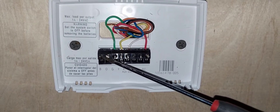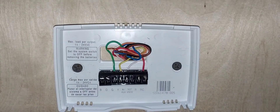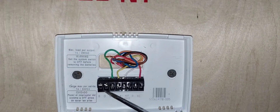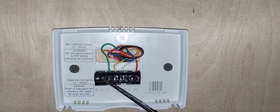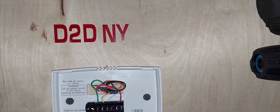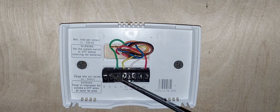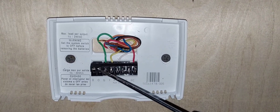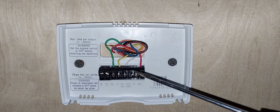If you're in the Northeast — like New York — then you put your heat pump reversing valve wire on the O terminal, because the system defaults to heating so you don't freeze and bust your pipes in winter. Whenever you call for cooling, the reversing valve will be activated. That's pretty much what B and O are for.